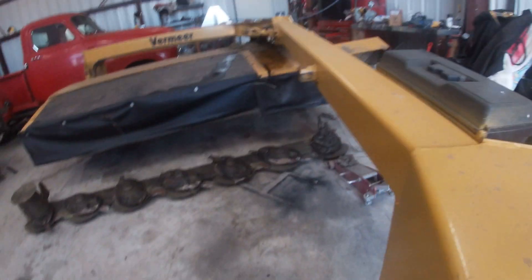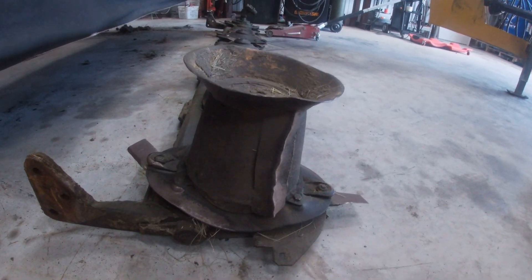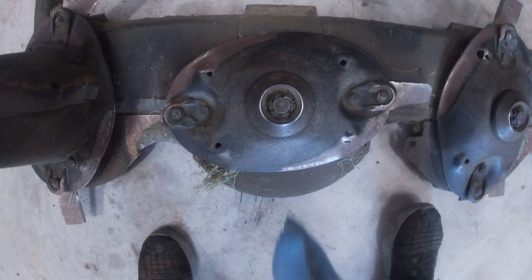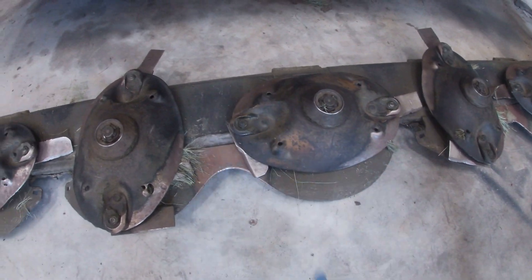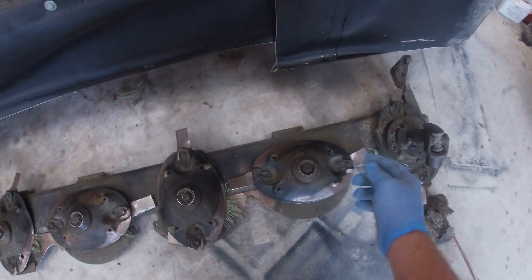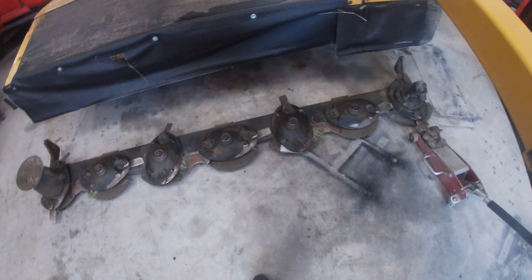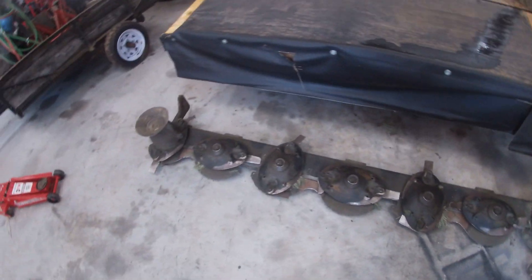There's the cutter bar. You have to start by taking these two bolts out, then you can take this nut off and everything starts coming off. You can see this line - this is a pod by itself. You take this turtle off and here's the pod. There are three bolts on each pod - you pull this guard off and that's how you can separate these. This piece in the center is just a spacer. By taking that off you have to slide everything off the shaft.